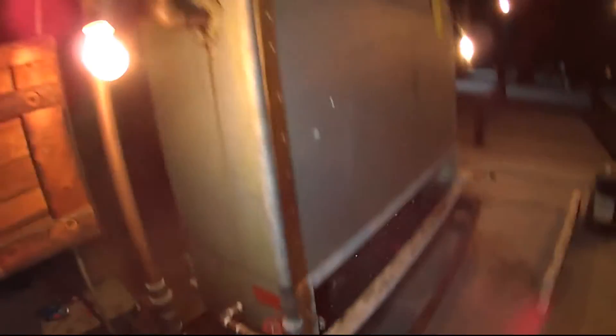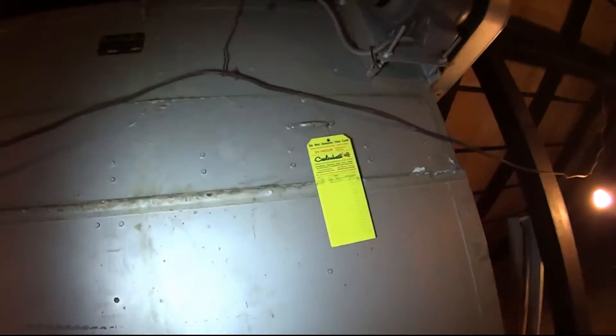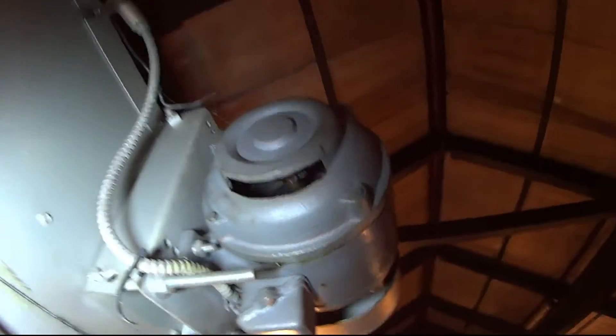Now the compressors are running. I need something to cycle this fan on and off. Right now the pump is still cavitating — not enough water. You hear they're sucking in air. Baltimore — the BAC Tower. Look at all that stuff I got out of the tower. Just water deposits that dried up. Insane.